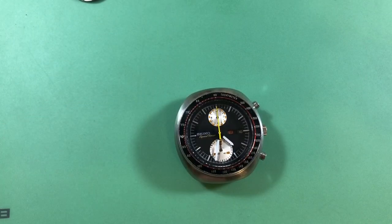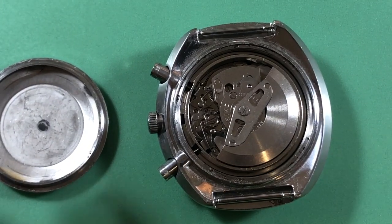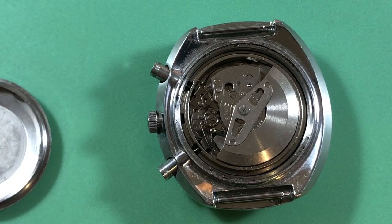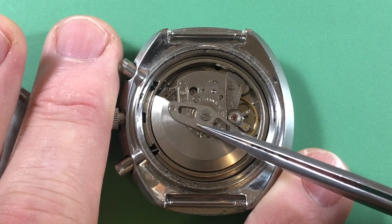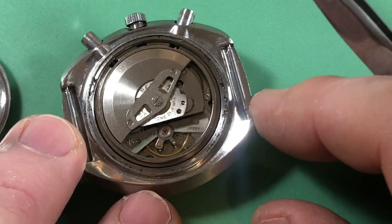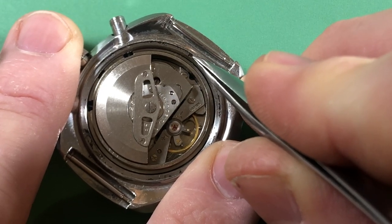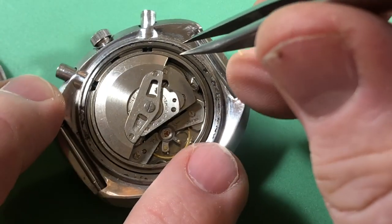Let's get that back off. We've got a nice little dot in the middle where the screw for the winding was touching the case back - I wonder why. We've got some case pitting and the case was refinished, so this is one that looks like it's definitely been in a hot and wet environment. There's definitely pitting in there.